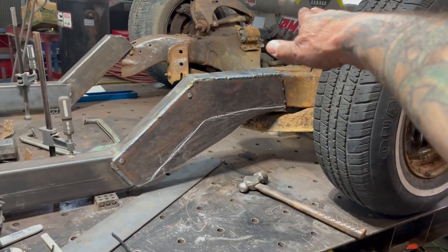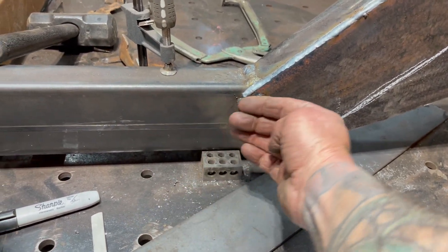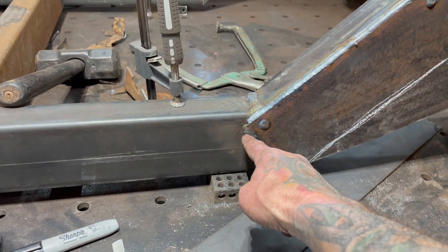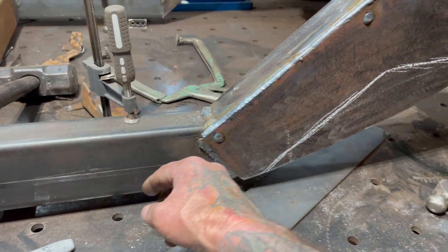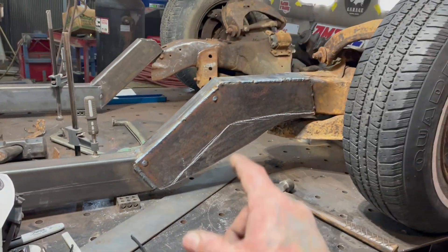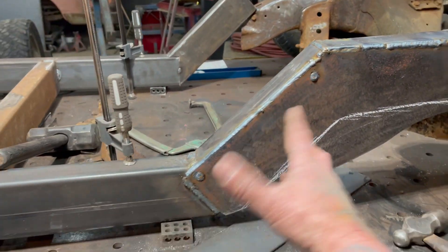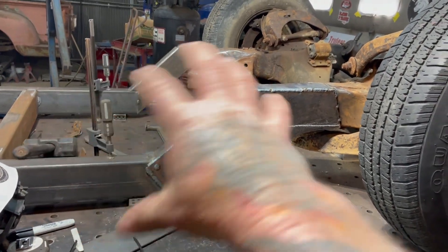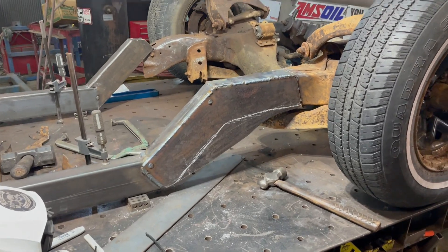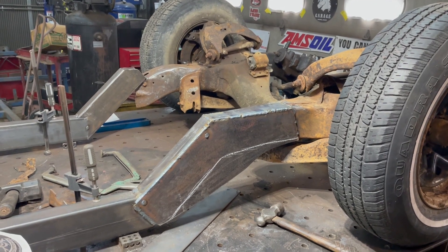I'll probably do that later and feather this out into the frame. I don't want to just use body filler, so I'll weld in a piece of thinner sheet metal so everything's smoothed out and looks nice. I'm not sure if I'm going to run any designs on the outside yet — I was thinking about just smoothing it out. It's going so well I might just leave it the way it is. I'll see you guys in the next video — please hit the subscribe button and the bell so you get notifications. Thanks for watching.